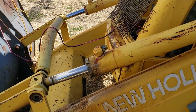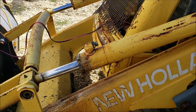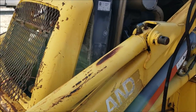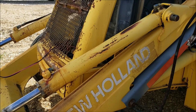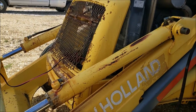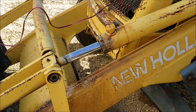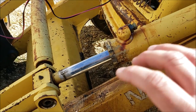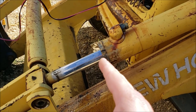That's why I left the cylinder here on the backhoe — so I could wrench on it pretty good and not have to worry about it slipping around in a vise. So I'm going to get this gland cap off, pull that pin, and hopefully by hand I'm going to be able to pull this off. If not, I'll just get my other tractor, put a loop on that thing with a little rope, and lift it straight up. Now if that cap doesn't come off very easy, you can still leave the stick of the cylinder attached and hit it a couple times — not going nuts with it — which should use the force to kind of pop that gland off.